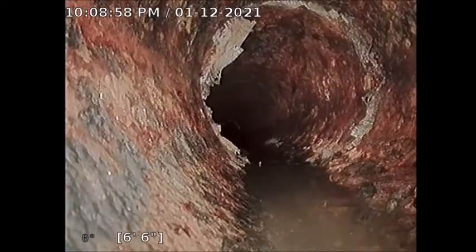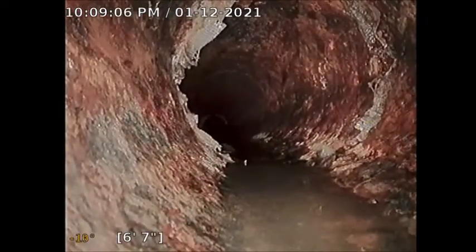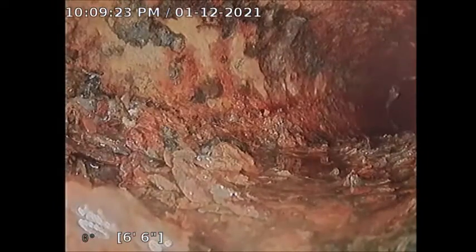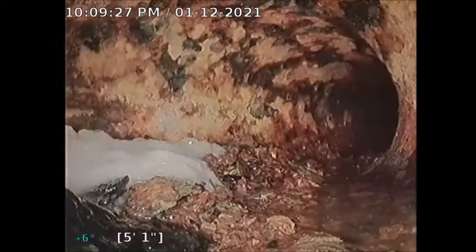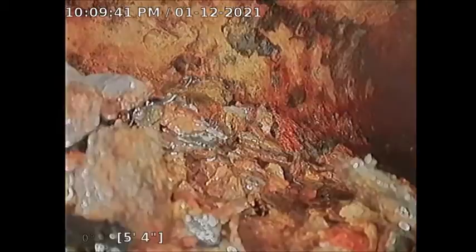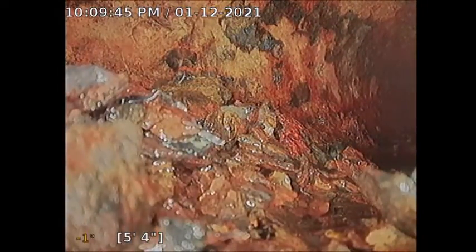This section of the pipe — we're not 100% sure, but if you look close at the bottom of the line, it almost looks like the cast iron has worn away. There's probably a 50-50 shot that, because of water wearing the pipe away, there might not even be any pipe on the bottom — it might just be dirt there. That cast iron looks really worn to me. And here's probably parts of the pipe that are piling up just five feet down the line from here. This is the place that was clogged today. To me, I think the bottom of that cast iron has worn out.